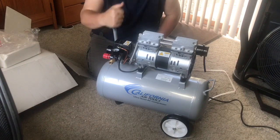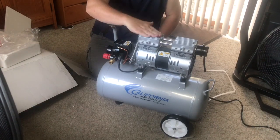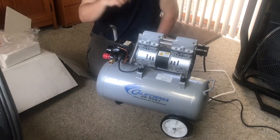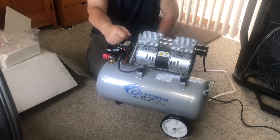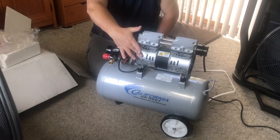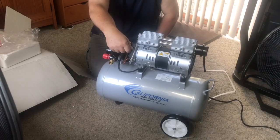Alright, and I'll listen to it back before I post this video like I said, and see if it works. That produces pretty good heat. So airbrushing at 25 psi, that's going to give you, with an 8 gallon tank, a good amount of time before it restarts. That'll give this motor time to cool down and recycle itself once it starts back up.